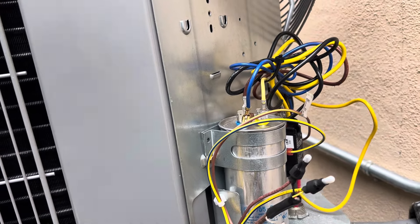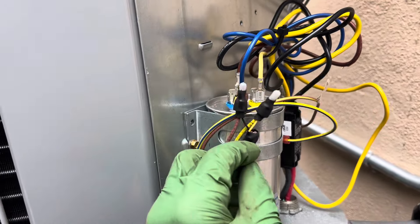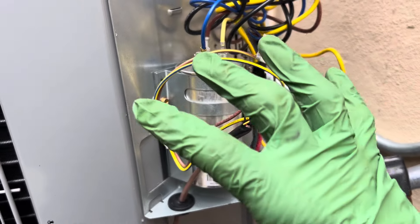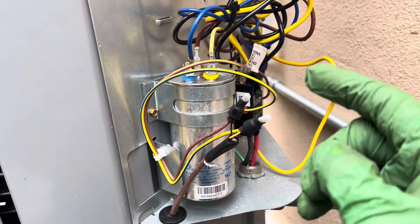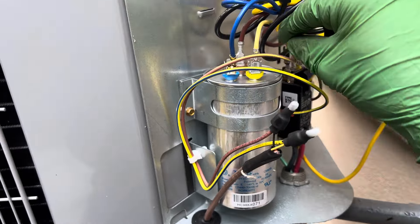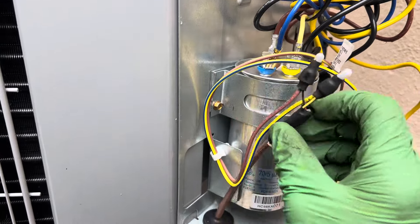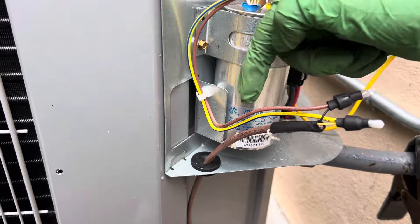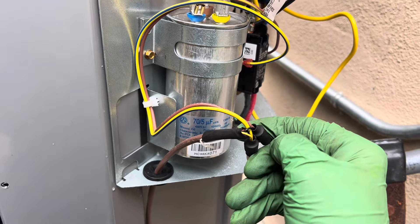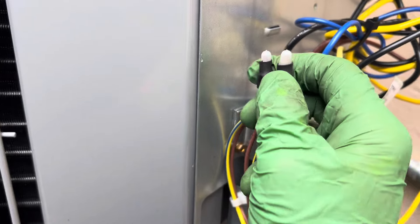We're right by the ocean — if you go to the top of this hill and look straight down, the fog with salt water comes up here. If you have marine-grade spray for electrical terminals, when doing a brand-new installation for electronics, spray everything down with the anti-corrosion sealing for all your connectors, because they all become green and crusty in salt air. Don't face connectors downward — you don't want condensate or rain filling up in your contacts. Always put them in an upright position so water doesn't get in.